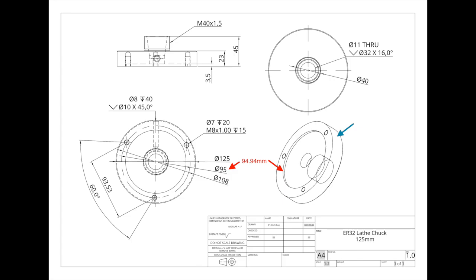I cleaned up the outer diameter to get a smooth, measurable surface, and then removed the collet chuck. Turned it around, bolted it back in different bolt holes just to see if it was going to remain concentric, which it didn't. That led me to check the fit of the recess to the actual back plate of the lathe, and there was play on that.